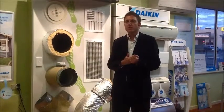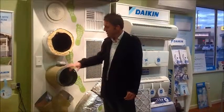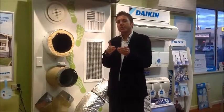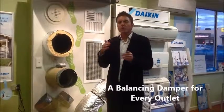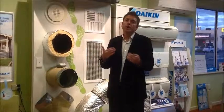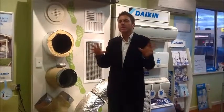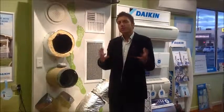To overcome that, we install what are called manual balancing blades, or air balancing blades — similar in principle to a zone motor but operated manually. Upon commissioning the system, our technicians balance these blades, reducing air where there's too much and opening damper blades where there's not enough. We put a manual balancing blade in for every outlet installed, so that upon completion of the balancing stage, the airflow to each room should be very much the same — regardless of where you are in the house or how far the outlet is from the unit in the roof space.